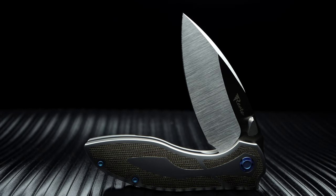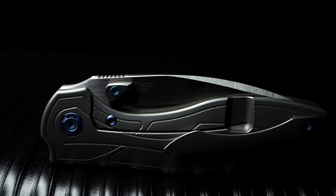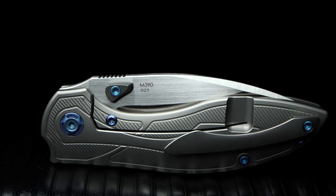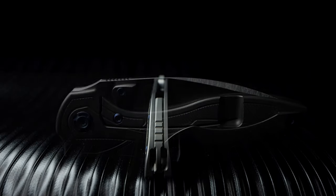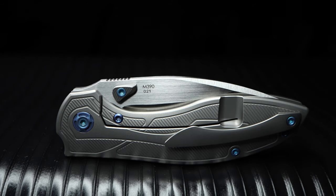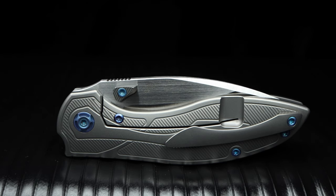Even still, I can't feel any of the seams whatsoever. On the non-show side of the knife, the inlay pattern is milled into the titanium with the addition of milled texture lines that provide adequate grip, and here is where the anodized hardware really shines — whether because it's the only accent on this side or because there are five screws here versus only two on the other. The backspacer is a solid chunk of titanium with thick but non-aggressive jimping and a lanyard slot recessed into the end. The pocket clip is milled from solid titanium in a mirror image, but flipped, of the front upper titanium inlay. It's sturdy and snug enough to hold the five-ounce knife in the pocket or on a waistband, but not so much tension as to be a nuisance when retrieving it.